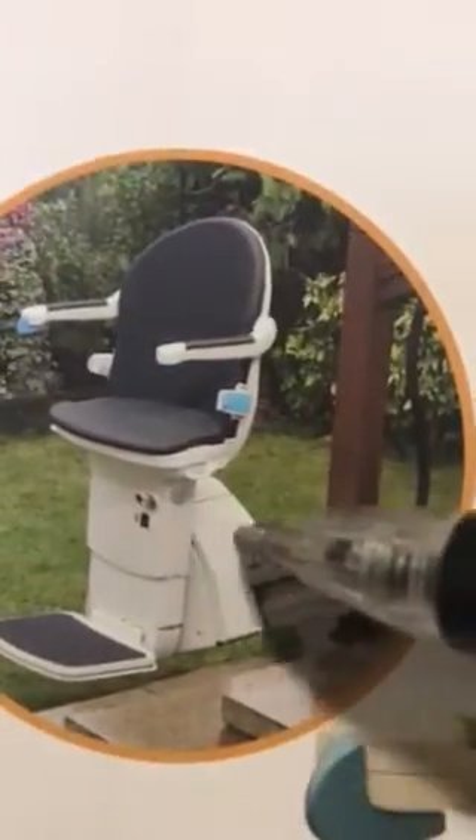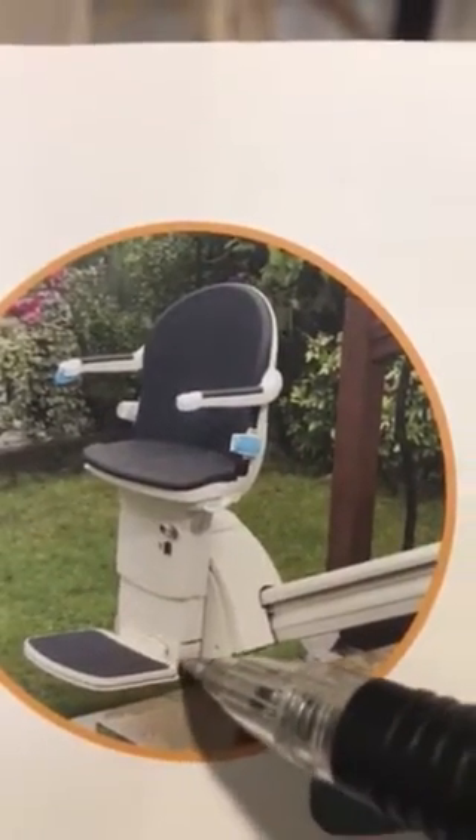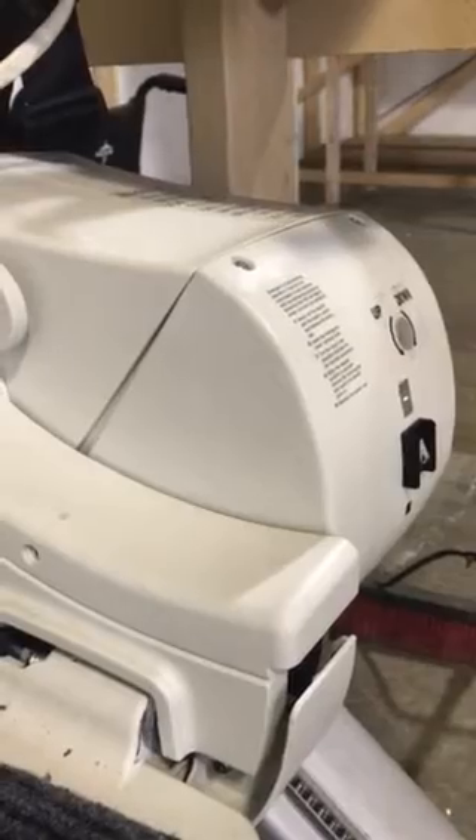Now, on the 1000 it's a little bit different as far as how it looks, but the safety edges are the same. You're going to have a safety edge here — this entire panel pushes in and out — on the opposite side of the motor as well. You've got your footplate, which I showed you when you fold it up; this bottom portion toggles back and forth. And directly behind the footplate is another safety edge. Sometimes, not all the time, but sometimes in the winter or if it's colder, it's common for these safety edges to get a little sticky because they are spring-loaded. But the simple fix is to toggle them back and forth.